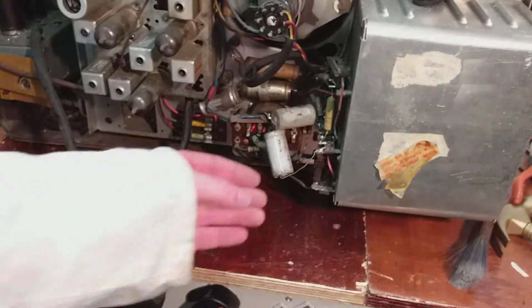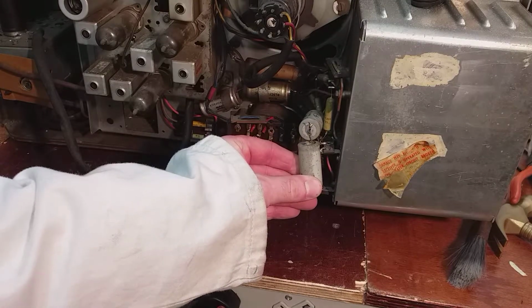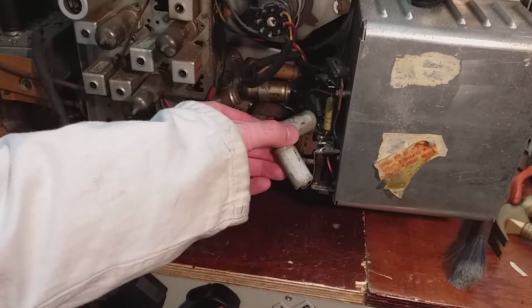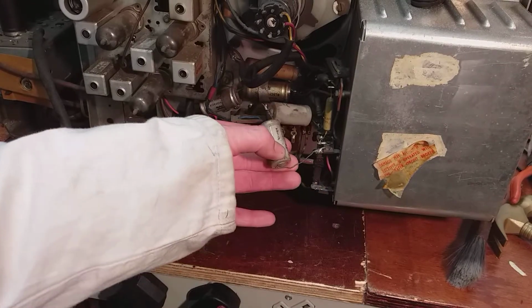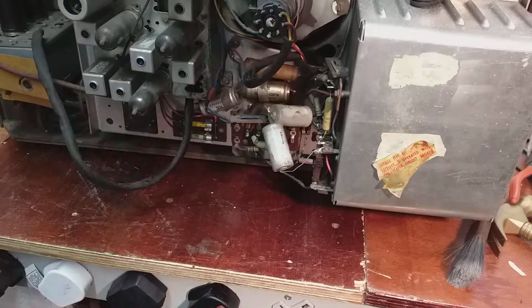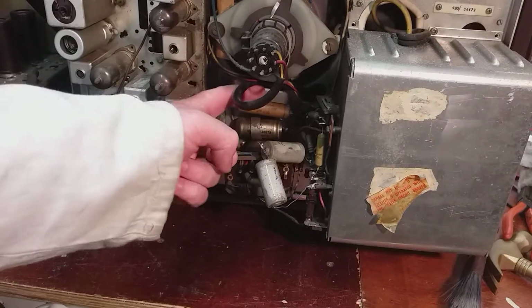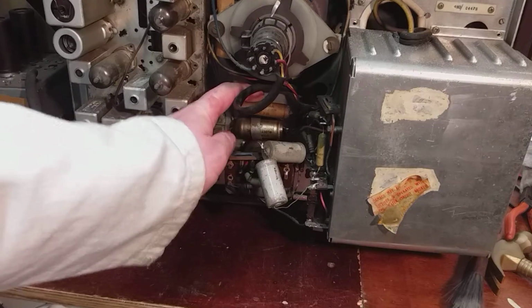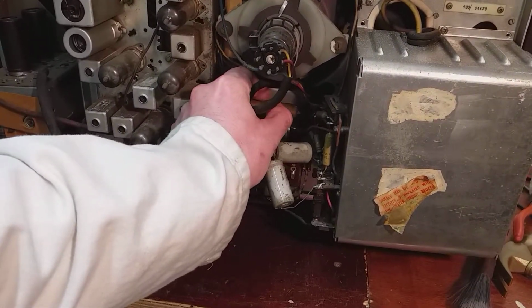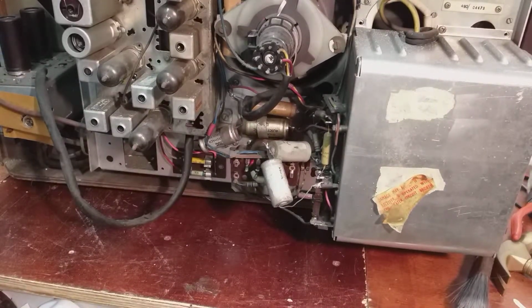And we can see here that someone's added in a couple of radio spares electrolytics, the two 16 microfarad 500 volt caps in series there. So it'll be interesting to see what that's about. And there's a big wax capacitor in there, 0.1 of 1000 volts, sorry, not 0.01. We could safely assume that we could change him.